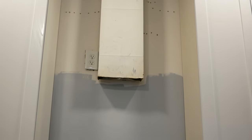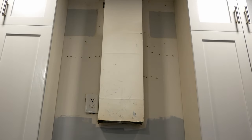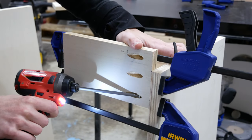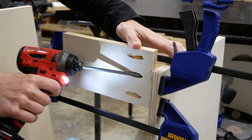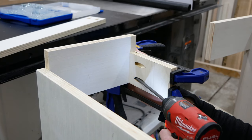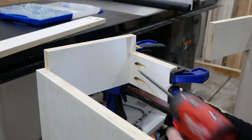I needed to add a cross piece at the top of the cabinet too, but the existing duct for my range hood comes down flat against the wall so I've got to build around it. To do so I screwed two pieces at the back top edge of the cabinet — these stick up a bit above the top so I'll be able to screw through them into the wall later — and then screwed smaller pieces perpendicular to the ends of those to account for the depth of the rectangular ducting.